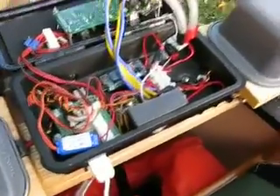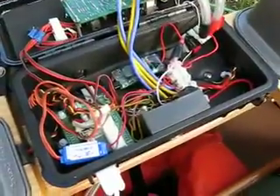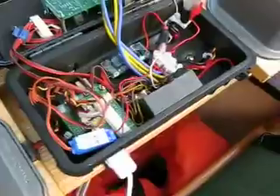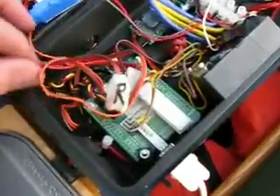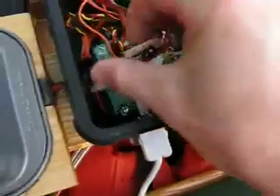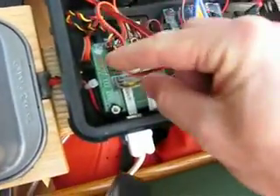There's enough friction mechanically for these motors that they will hold — they'll mostly hold their course, less so in reverse. And just to look a little bit more closely, what I have here is an Arduino. I use the SparkFun sort of prototype shield so that I could solder on a group of headers for these servos.